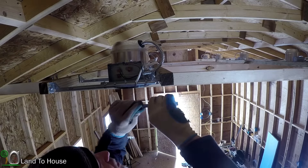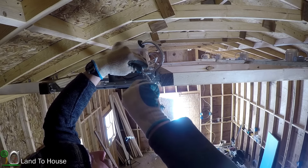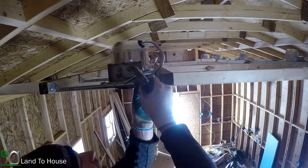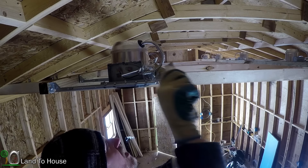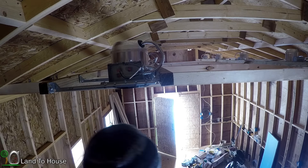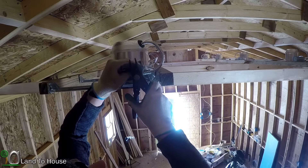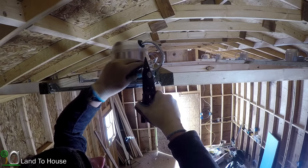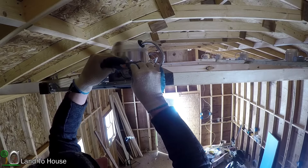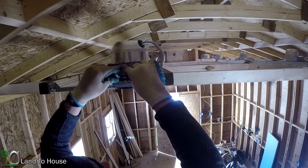Now I need to take my razor blade and cut back a few inches of this sheathing and remove it. There's usually a piece of paper around the ground wire — remove that as well. Now I need to strip the black and white wire with my wire strippers, going about a half inch. Then I'm going to take the little nuts that come with the light and attach ground to ground, black to black, and white to white.